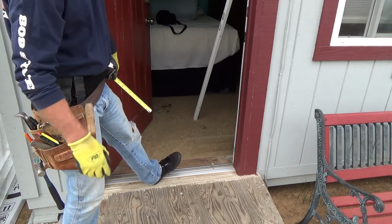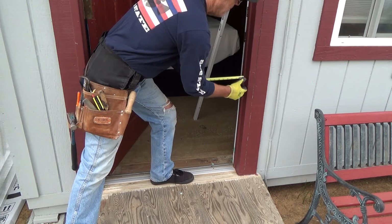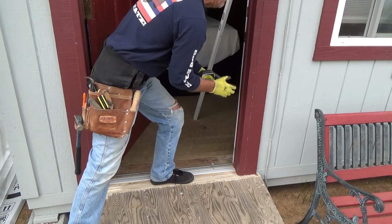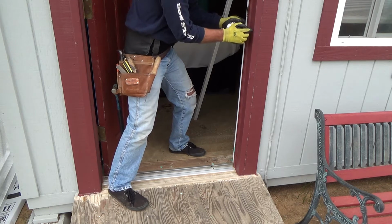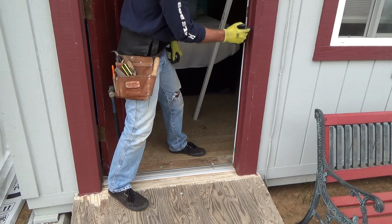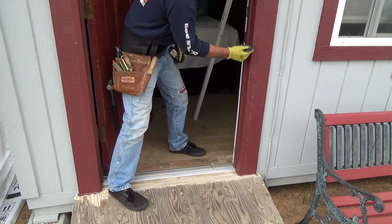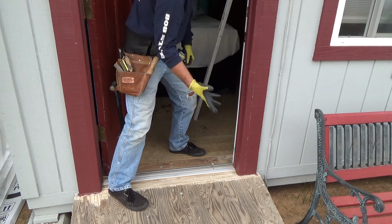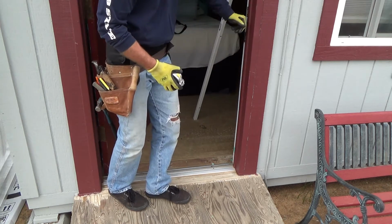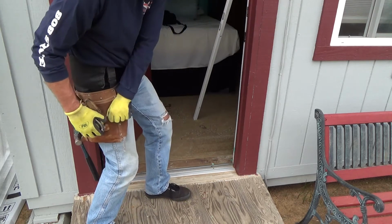Paint it, you won't even really know it's there per se. Okay, but we've got that gap there. And just going back further, if this door jamb was cut shorter, it'd be cut back 3/4 of an inch. Then this trim really fits over the edge of this, okay? And it comes over and gives you a slight reveal or whatever they do on the exterior. They might have it flush with this. They might have a 1/4 inch back, whatever, okay?